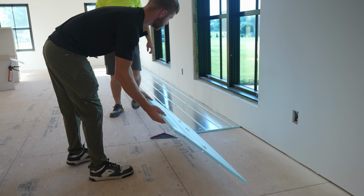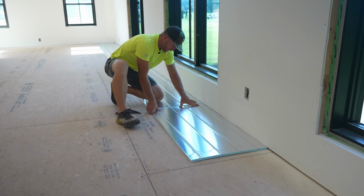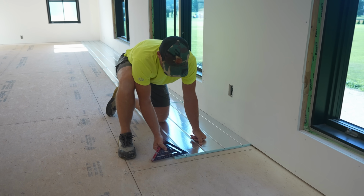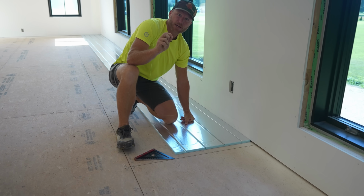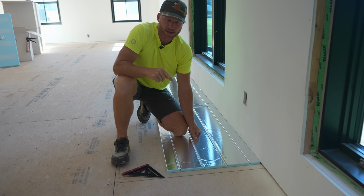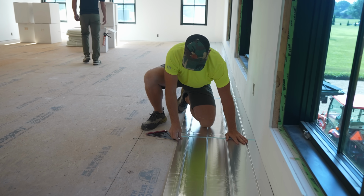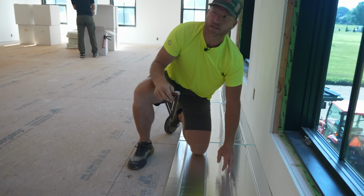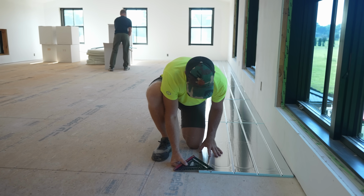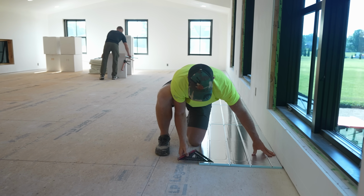You know, this is gonna probably make the floor quieter. 100%. One thing that I did read is that when we do this LVP, because it's not like a hardwood or a cement-based product, it needs to be low temperature. I think the maximum the heat can come through here is, and don't quote me because I read it a while ago and talked to my flooring manufacturer, which is Floret, they said I just had to keep it down to like, I thought it was 80 some degrees. I remember you saying that. Or maybe it was 79 degrees. I thought it was in the 80s. Yeah, I can't remember. But that's fine because you don't want your floor temperature to be super hot anyway. You want it to just stay lukewarm and run constantly.